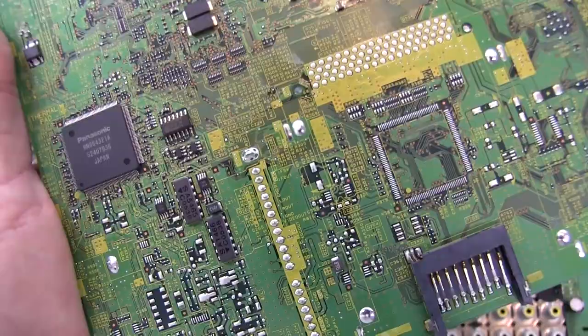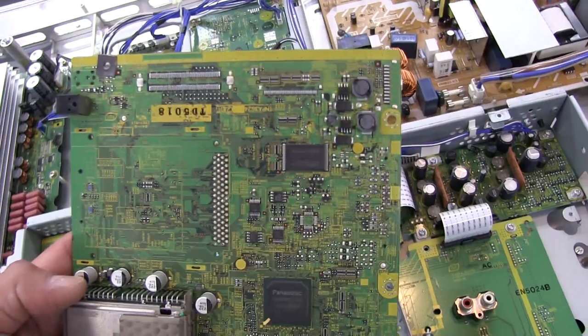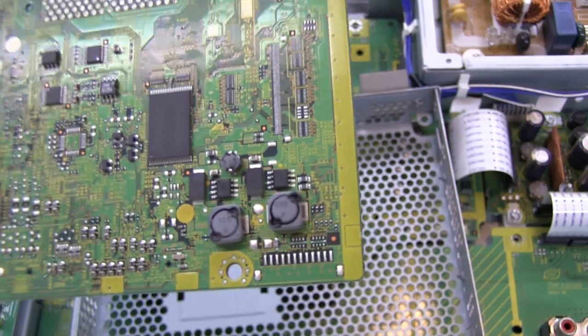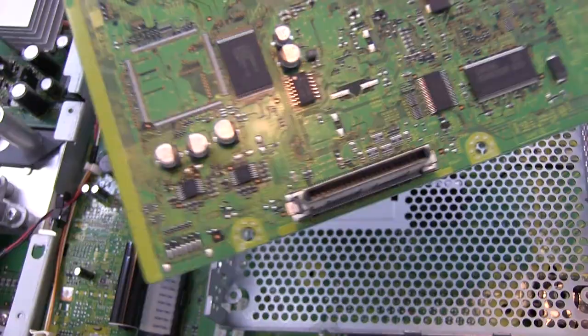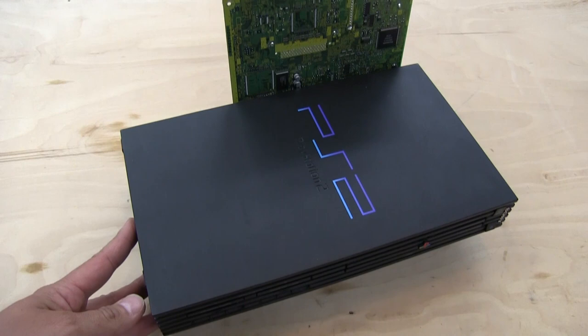There are components marked XF 200 and 201 — I'm wondering if they're some sort of oscillator or resonator. And that's just the tuner. There's a small power supply section in this corner with inductors and driver ICs — those look like MOSFETs, and these are probably the actual controllers on the bottom. He's the world's only PS2 with a TV tuner — no, this would not actually work.